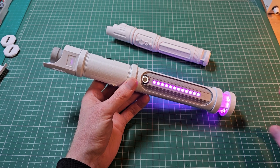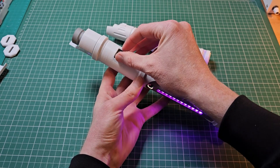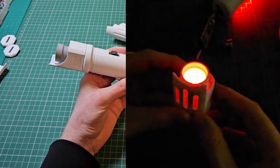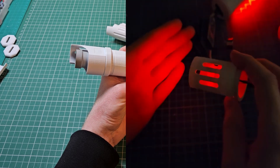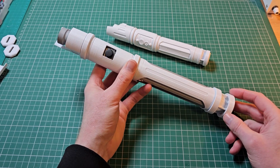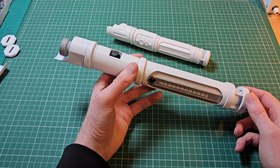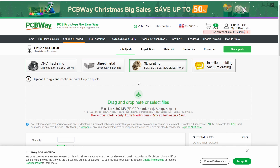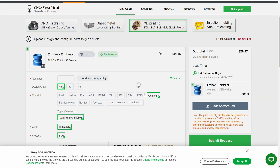The current version looks something like this. There are definitely improvements I'd like to make, but the good thing is I can redesign and print new modules as often as I need to. Each module includes the same 4-pin magnetic connectors on the top and bottom — unless they're an end piece — so they can be stacked and swapped. The emitter includes a smaller screw thread that allows it to be swapped. When I started testing, I could see that the white PLA piece would let light from the emitter NeoPixels bleed through, which I wasn't pleased with. I reached out to PCBWay and they offered to reprint not only the emitter but the surround for the UPS in aluminium. These pieces have a great finish and make the whole build feel more sturdy and realistic. I love how they create the illusion of an internal core running through the hilt, and the metal makes the build heavier and more satisfying to hold. The process was easy — I used the STL files I already generated, dropped them into the website, and completed the order. I definitely recommend printing those pieces in aluminium.